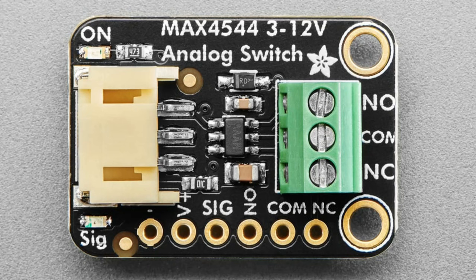It's perfect for analog signals like NTSC, PAL, audio, or sensor data. What it's not good for is power — it's not a mechanical connection; it's an analog pass-through connection with MOSFETs, so you won't get full electrical isolation (the ground is still shared), and you can't source power through it. It's only for signals. The connections are bidirectional, but analog only — signal, not power.